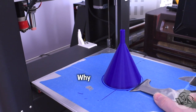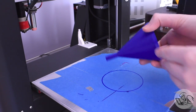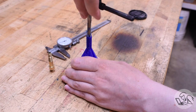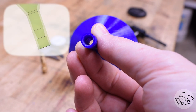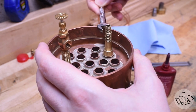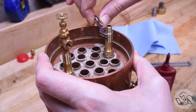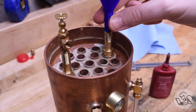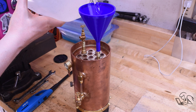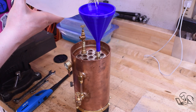Let's start with a funnel. One of the things I like to do with my 3D printer is make custom funnels for tasks that I'm going to be doing a lot of, such as filling this boiler. I print them with the tapping drill size as the opening, and then I can just thread it to fit the boiler fitting that I need. There's actually a little shelf in there that sits on top and directs the water inward so it's less inclined to leak. Now I can replace the blanking plug with the second standpipe that holds the safety valve, and my shiny new custom funnel threads on there. It doesn't spill a single drop, and it only takes a little while to print a funnel like that.